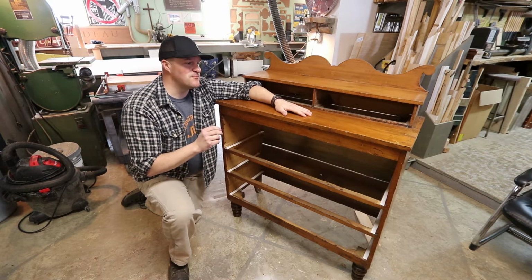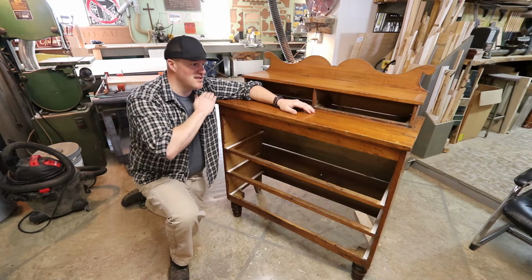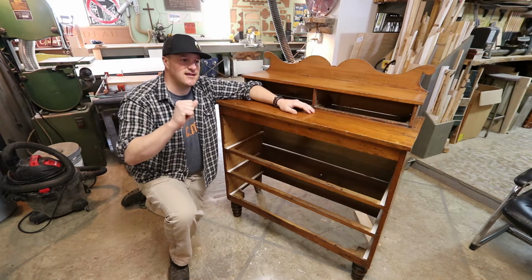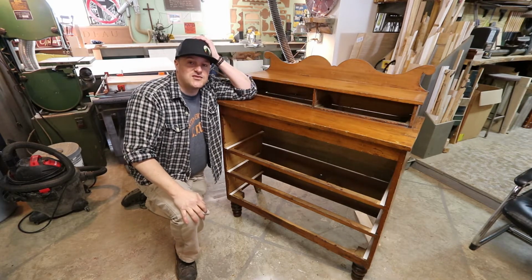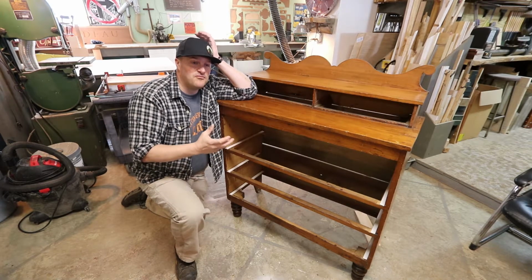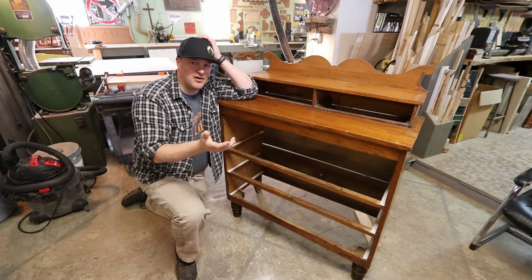It's amazing. I mean, when we clean our houses, we get out the Pledge and we get the dust off. Every time we do that, we add a layer of wax. Depending on what you may use for a furniture polish, there's years and years and layers and layers of finish built up on that. And in order to properly polish a piece of furniture, we need to get that off, so anything waxy or oily that may have been put on it.